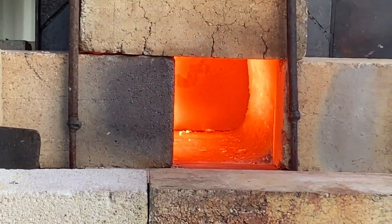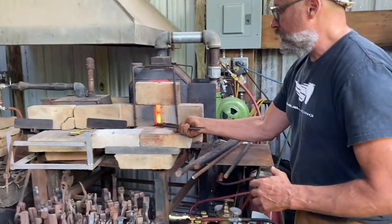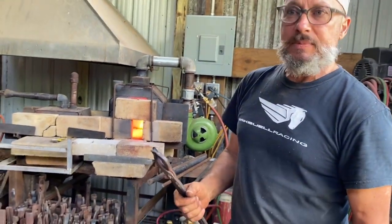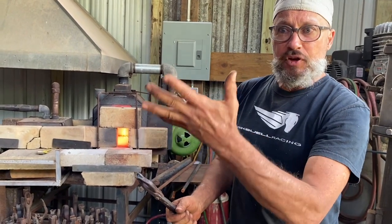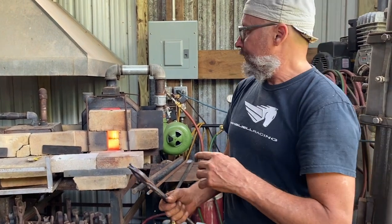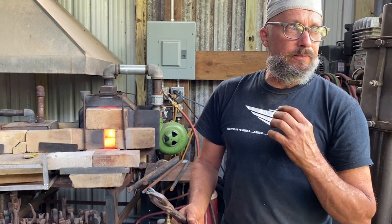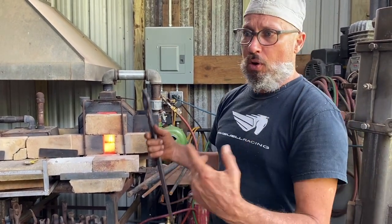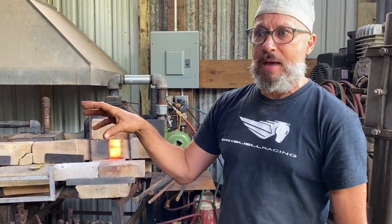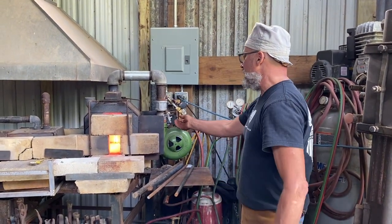The chamber is rigidized. Now I use ITC zirconium sand on what is left of the Kaowool. It's called ITC, International Technical Coatings. You can get the utmost performance from the fuel if it is reflected back as light and heat back into your workpiece. So anyway, that's the idea behind this.